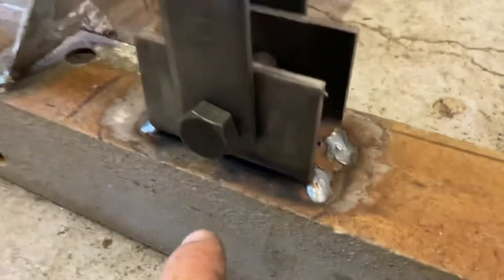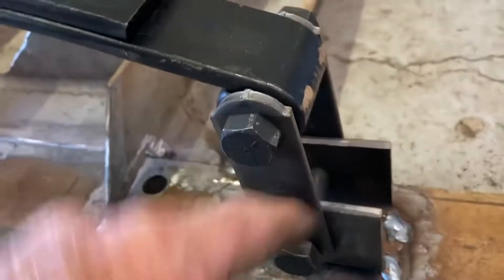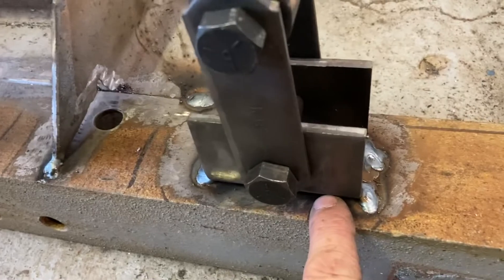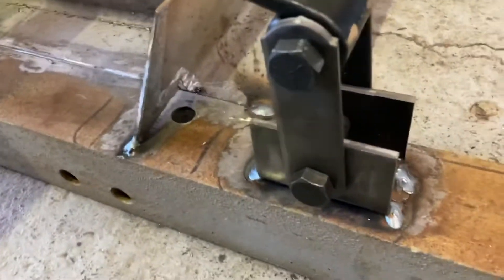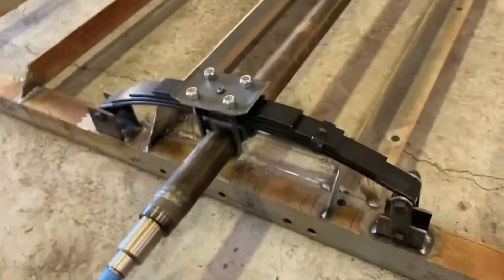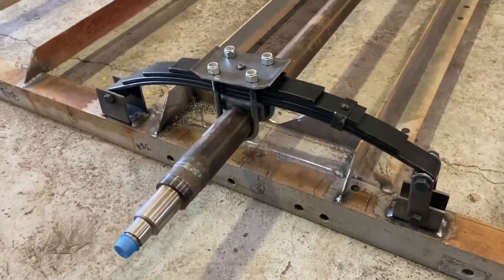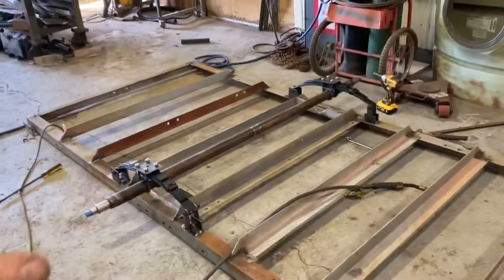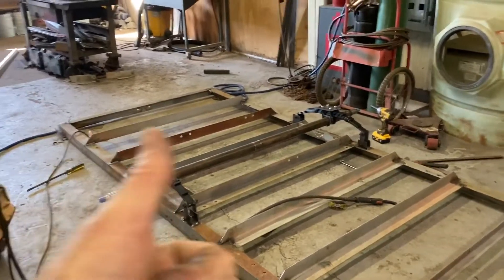One other thing — once those are torqued, the final last thing will be to lay a bead of weld in on each side on those little pieces so everything stays nice and centered. I read online that you're not supposed to weld on the spindle end itself because of the tension it creates, and that kind of made sense to me, so that's what I did. If that's wrong or you've got a reason why, throw it in the comments. Thanks for watching — hopefully this helps. Check back in a bit — I hope to have the trailer done here shortly and putting the jeep on it.